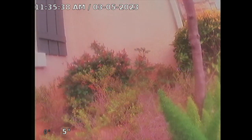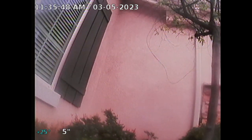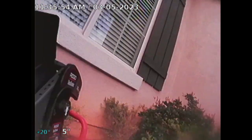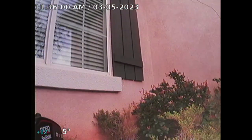That's your sewer line inspection. Everything else appears serviceable. We did underneath the property — not 100% of it, but most of it — and then your main sewer line. There is an issue, so I do recommend having this sewer line further reviewed and repaired. That means they should inspect the entire sewer line from the rear — put a camera in everywhere — because now we've found an issue. When the plumber is here, have them review the main line, give you a price quote, and put the camera in all areas they can, just to make sure everything is okay. Thank you very much. Give me a call if you have any questions.